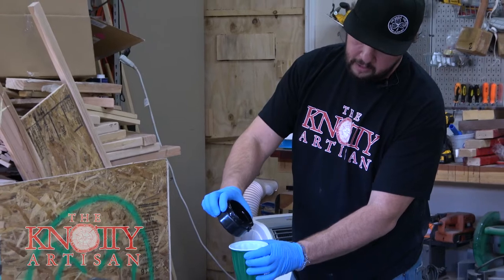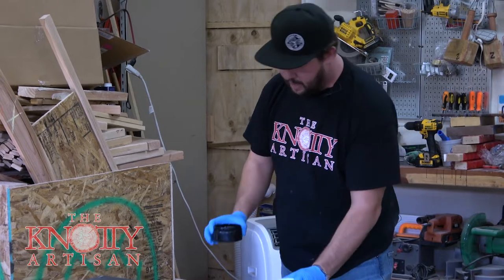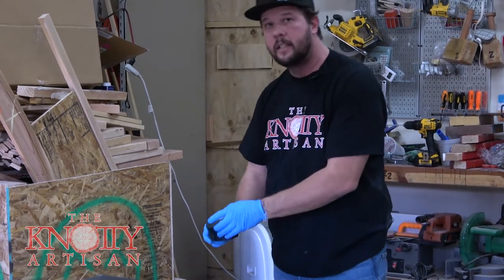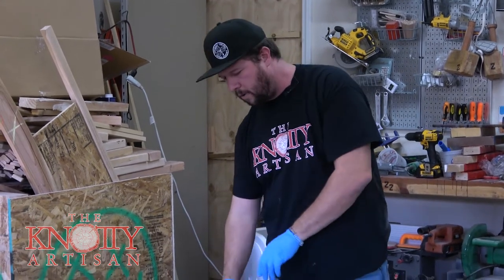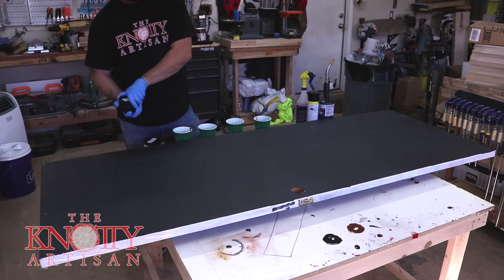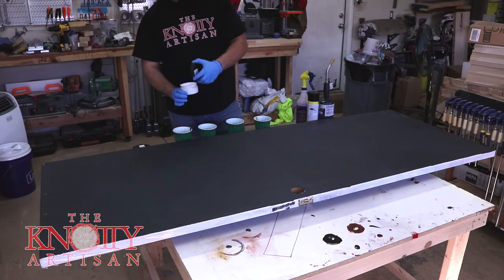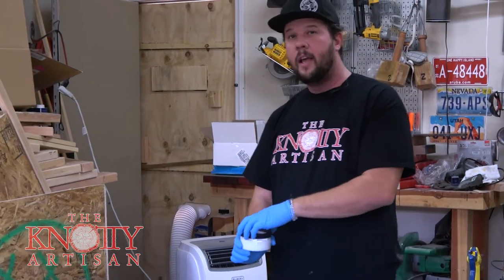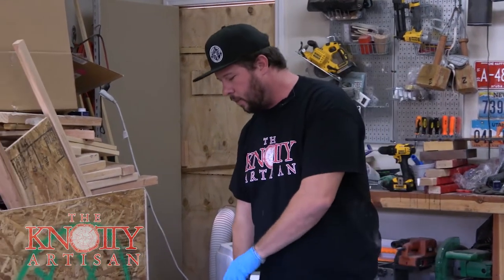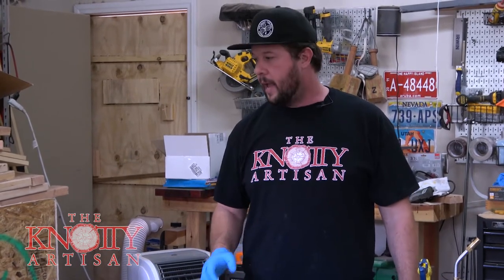This is Stone Coat Epoxy's black base tint. When you're going for this effect, you want to use at least a couple of base tints and two to three metallics. The base tints and the metallics really react with each other and give you those cool looks you're looking for. I've prepped this door using the Broadway black base primer. It's actually sat for a couple of weeks — we want to make sure the primer is set up and dried really well. If you rush your primer, you risk releasing ammonia into your epoxy and yellowing it over time.